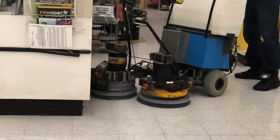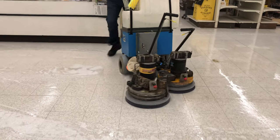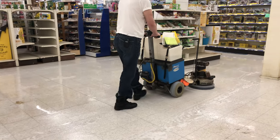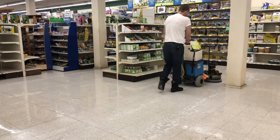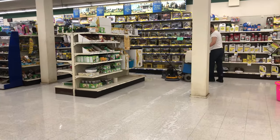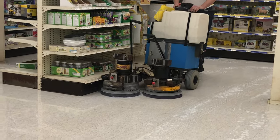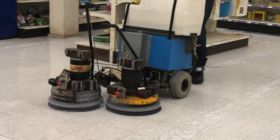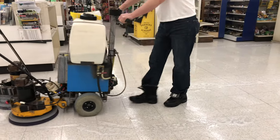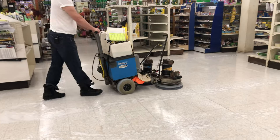And then I'll go around, I'll hit this for a second time just to make sure I scrubbed everything, it's the way we want it. And what this does too is this takes a layer of floor finish off, so now the remaining stripper can penetrate deeper to get further down into the wax surface. So this is an important step to go over it twice, because I get a little bit extra dwell time, and I end up with a better, more even result. Now this stripper and the new strippers, this won't take this floor down to where it's chalky looking, where it's completely stripped, but that's okay, because the little bit that's left behind acts like a sealer, and we use less finish that way.